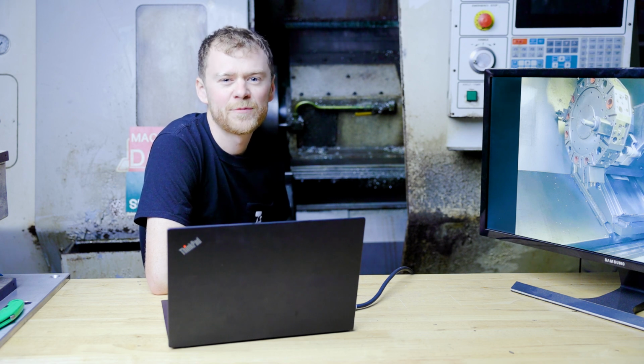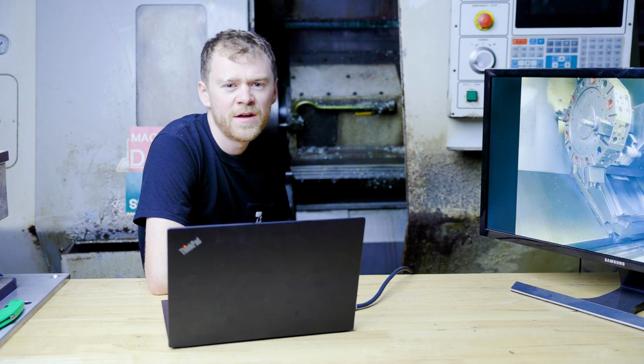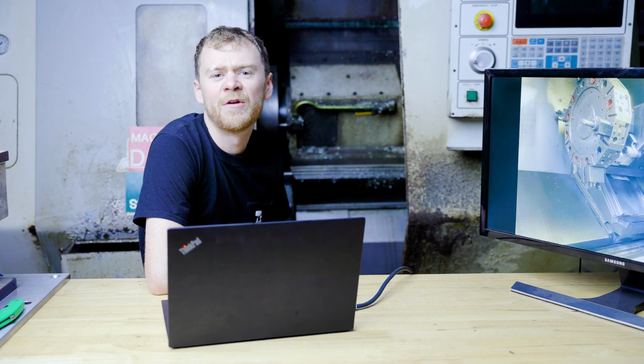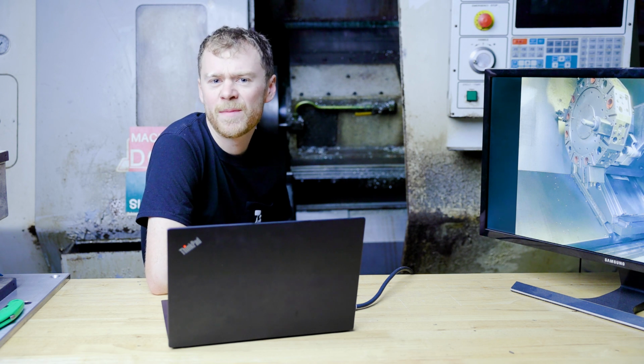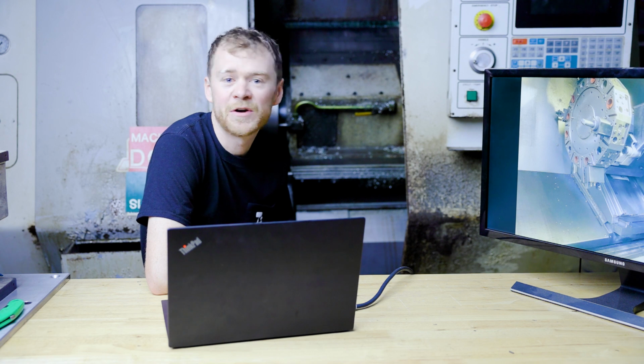I spent some time, troubleshot it, got some parts ordered, and ended up doing a full alignment and rebuilding everything under the wedge, took the turret off, took the subspindle off, put in all new screws and rails. So I'm gonna click through the pictures and talk about what I did in case it might help you, or you might be interested in doing something like this one day.